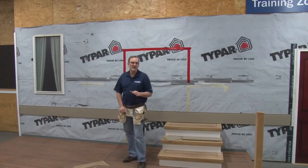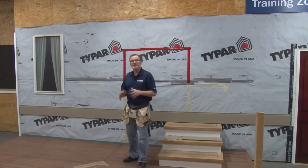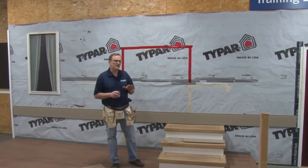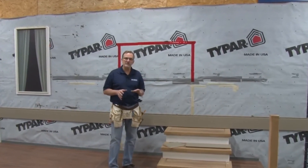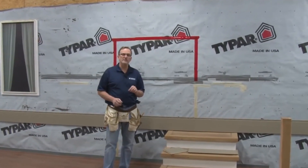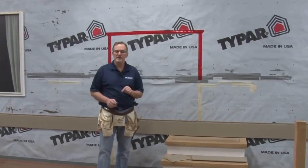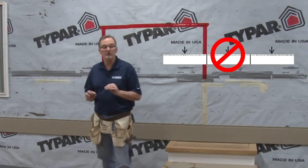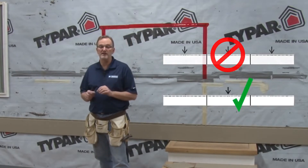Now that we've finished the entire first course — which, remember, is longer than 12 foot or one panel in length — we're going to do something that's very, very important. In fact, it's essential to the success of the installation. And that is, we're going to pin the center of the course. Now let me be clear about that: we're not going to pin the center of each panel, but we're pinning the center of each course of siding.